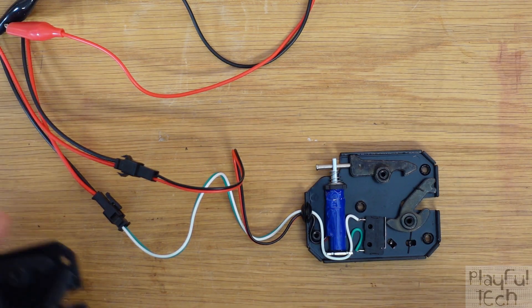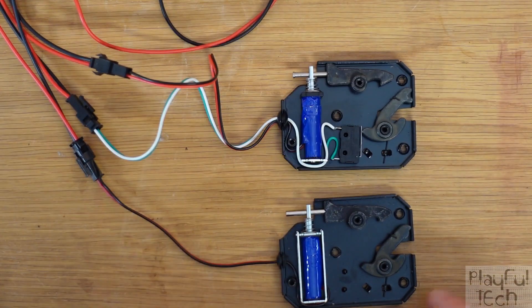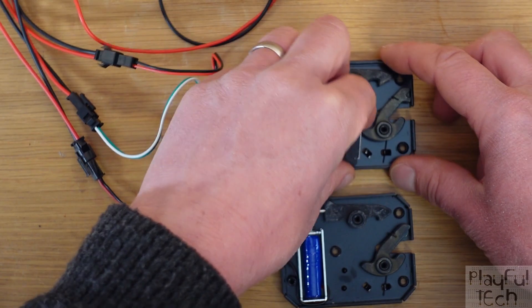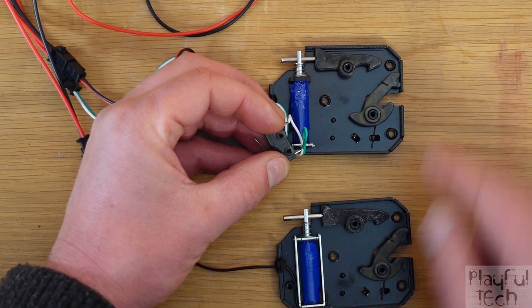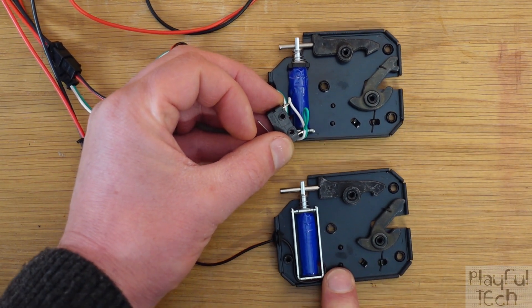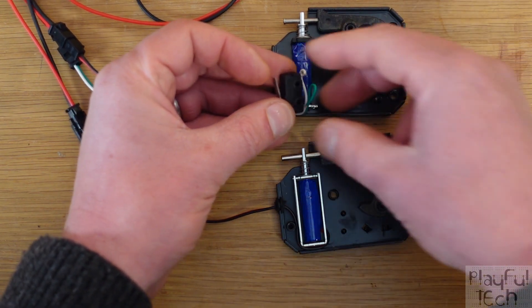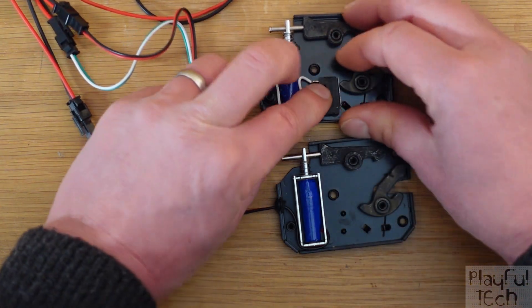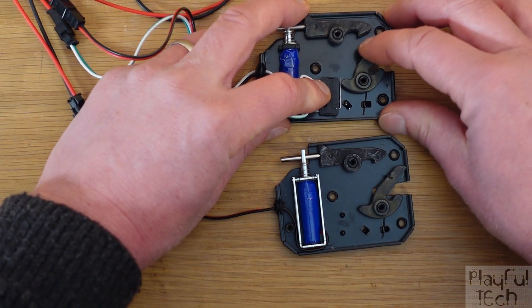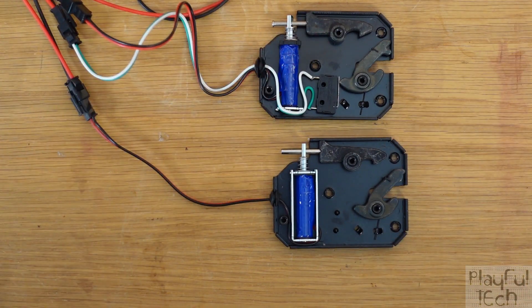If you have the original style lock, you might notice that you can actually insert a microswitch here. This is just a basic microswitch resting on these two little nodules, which are actually present even in the mag lock that wasn't designed to have those additional wires — the points are still there. So you can install these in existing cabinet style mag locks. Get ones with the long arm levers so that they touch the little anvil of the hammer, and that's how you can have a self-resetting cabinet style mag lock circuit.